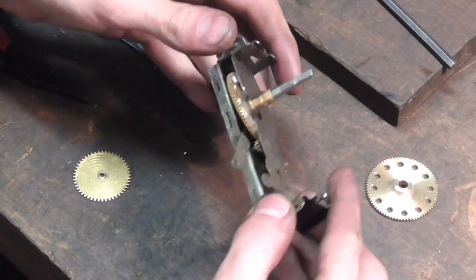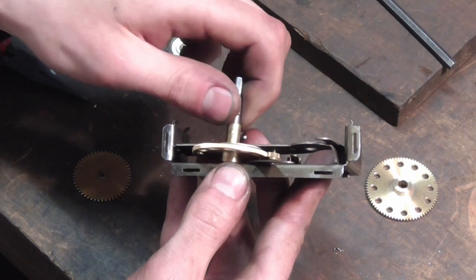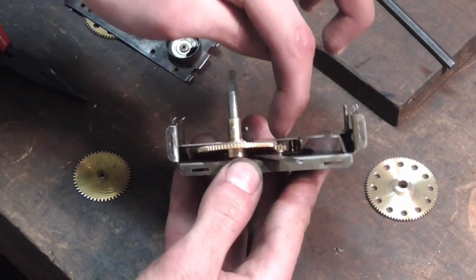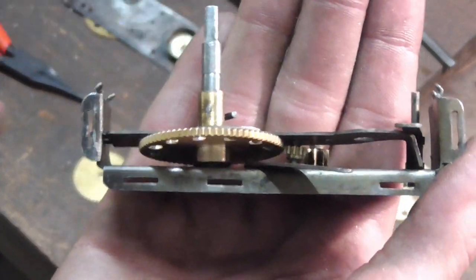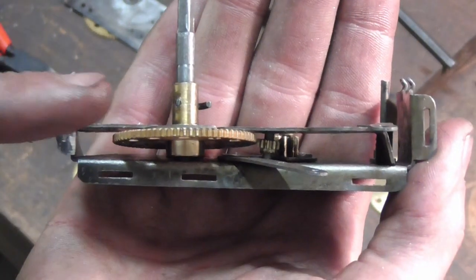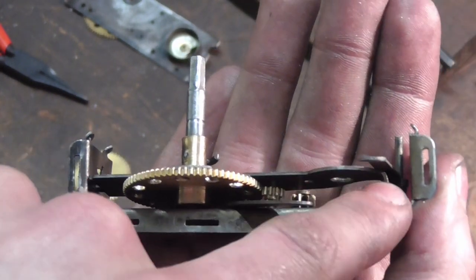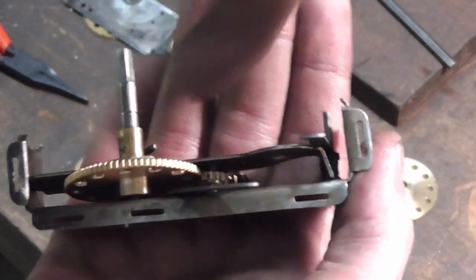Another one of countless test fits. You can see that the gear engagement is very poor — the teeth aren't fully engaging all the time and it's not properly in mesh. Have you noticed how tilted this shaft with the small pinion is? It is leaning away from the big gear, and I think that's because this piece here is bent so crooked. See how it's at an angle and droops away like that. My idea is: if I heat this up, bend it straight, and then re-bend it a couple of millimeters further to the right, then this should sit parallel and closer over there.